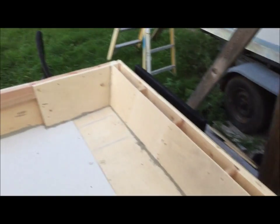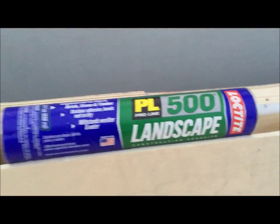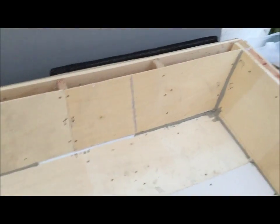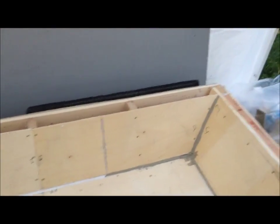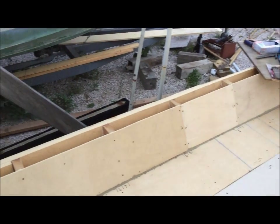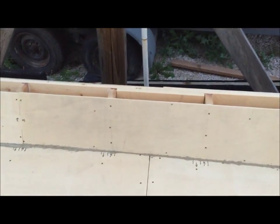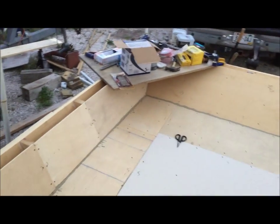The entire floor and sides are glued and screwed into place. We tried something new this time — a couple of those white spots you see are leftover paneling adhesive, and then I went out and got some PL 500 landscape caulk. Some of these side pieces were sitting up a little bit and left gaps at the bottom, so instead of wasting a ton of thickened epoxy or thickened polyester resin to fill those gaps, I just filled them in with caulk. That's where we are at now — I have to go catch an escaped chicken, so later.